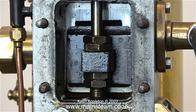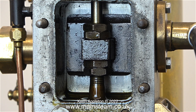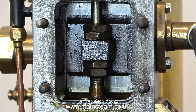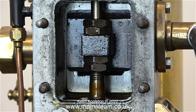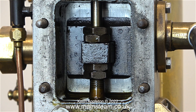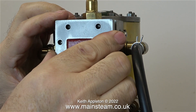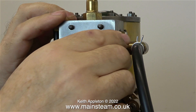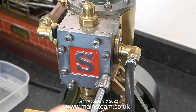I've changed the position of the camera and once again you can clearly see the operation of the slide valve. I don't see this very often, but the ports are not in the right place — possibly when the steam chest was machined it wasn't held correctly. This engine runs exceedingly well so I'm not going to start grinding the ports and make them look nice at the expense of the engine's performance.